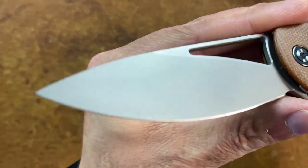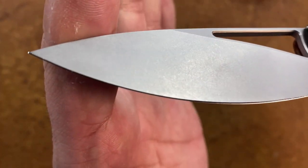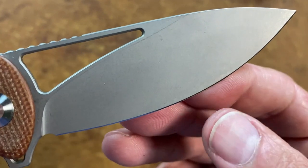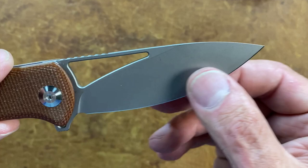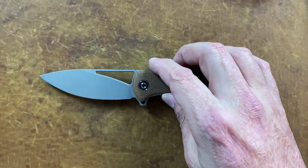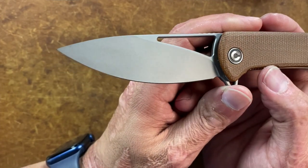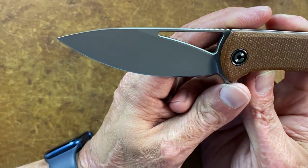Let's take a closer look at this knife. The edge didn't take much damage, nor did the finish — it's just a blasted finish that's been lightly stonewashed. On the other side, no major scratches from the copper and no copper deposits. You can see a little bit of the blasting lightening up down here — not an issue. This edge did not take any major damage whatsoever and it's still sharp. All I did was strop it right before starting the cable cutting, and as you can see this thing went through it with a breeze. One awesome thing about 14C28N besides being stainless: it strops up very, very nicely and takes a super keen edge. I think 14C was used in razor blades to get that very fine apex.